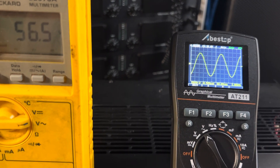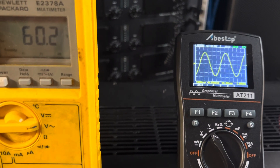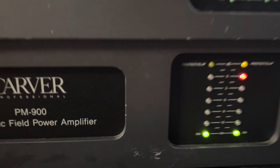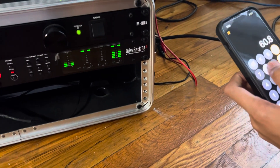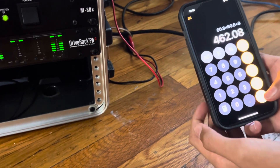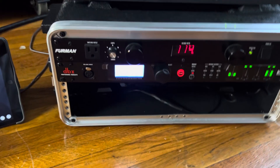There's clipping — go down one. Right there, the clip light is barely lit and it's doing 60.8 volts. Let's do the math: 60.8 times 60.8 divided by 8 ohms gives us 462 watts. So these things are rated pretty darn conservatively.